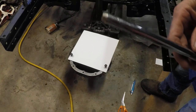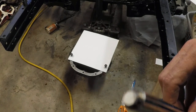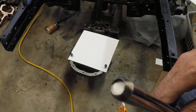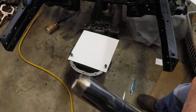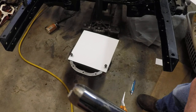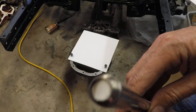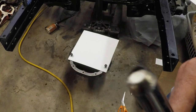If you've never done it, you can take a piece of pipe — a piece of thin tubing — and basically make a hole punch that you can drive with a hammer. Put a board underneath your paper, drive it with a hammer, and it makes a hole punch. Just grind a bevel around the outer edge and you'll punch a hole the same size as the ID of the tubing or pipe. So that worked.